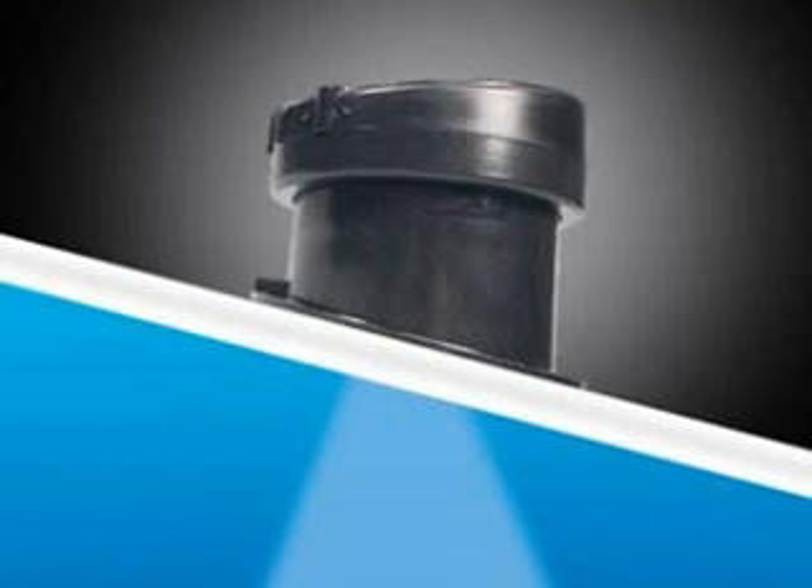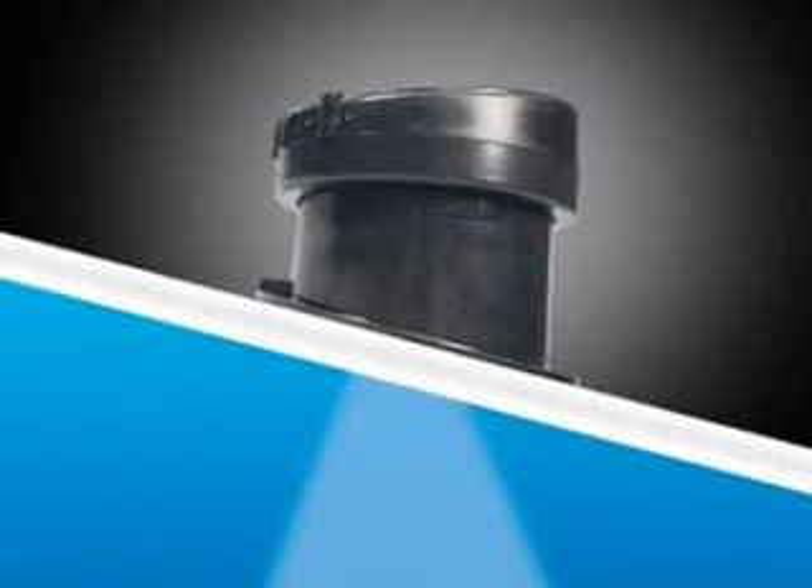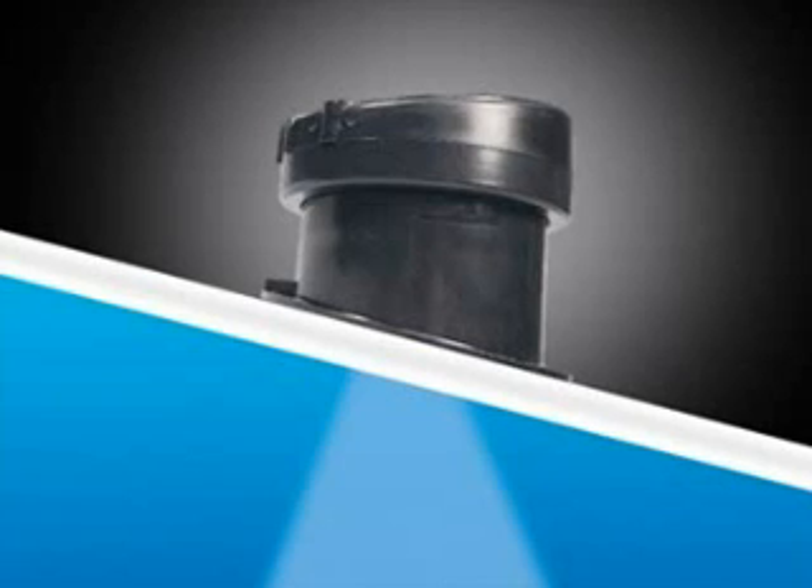It's important that the cylinder be filled with water, or for colder climates, with mineral oil or engine coolant. There must not be any air or air bubbles between the bottom of the transducer and the hull.